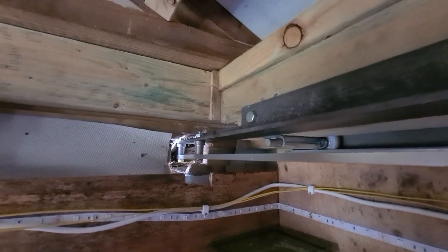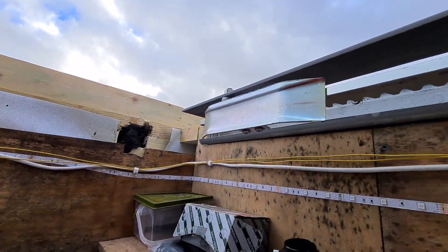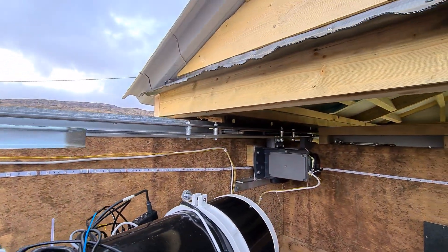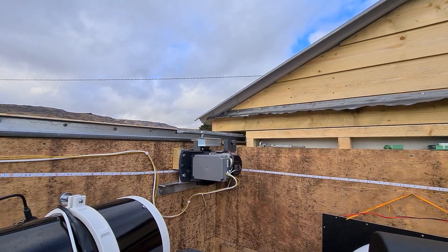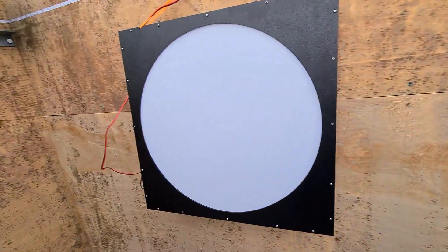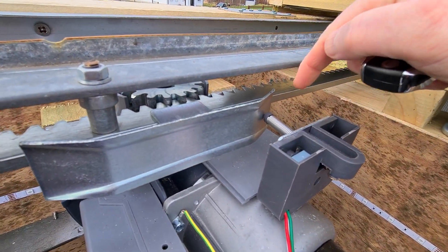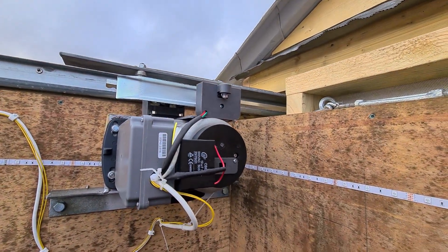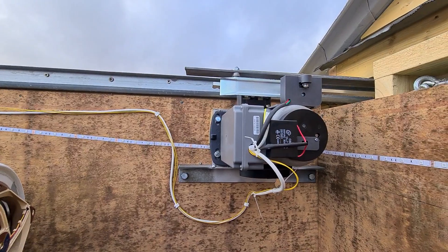I'll show you how this works. We have the rail coming out here. If I toggle the roof open, you can see there's quite a bit of rail extending out through the wall — enough rail to push the roof all the way past the north wall. Then it gets stopped by a limit switch right there, triggered by this little ramp. In a minute or so the roof will automatically close by itself, because right now it's daylight and the CloudWatcher considers it unsafe — it's set to close the roof automatically if it's unsafe.